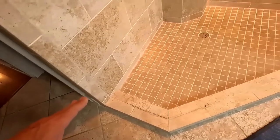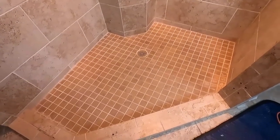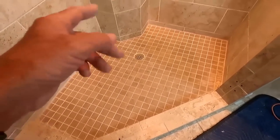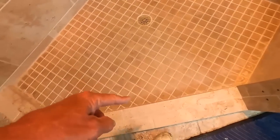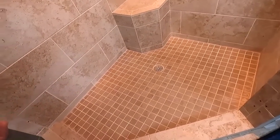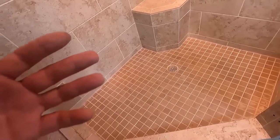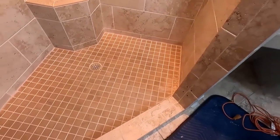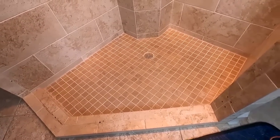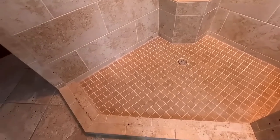I am here to find out, as I've said on many videos in the past, I have to kill the patient to find the disease. So when somebody says, hey, my shower pan is leaking and they're trying a quick fix, putting caulking and silicone to mitigate some of the cracks, that is not your waterproofer. If you already have a leak, you already have damage. Somewhere there is a screw up that when they built the shower, they should not have done. And you cannot know that unless you had x-ray vision to find out what they did. In the rare cases where somebody's taken pictures, yes, but that's the exception, not the rule.